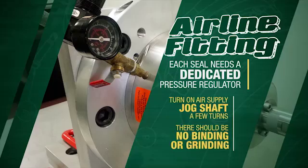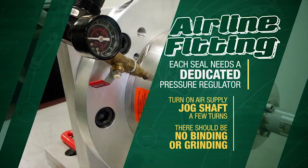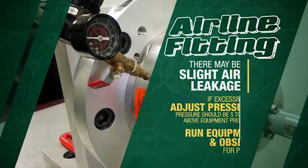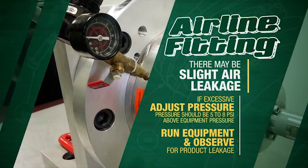Turn on air supply and jog shaft a few turns. There should be no binding or grinding. There may be a slight air leakage. If excessive, adjust pressure so there is minimum leakage.